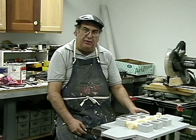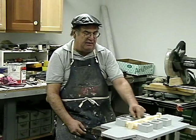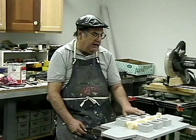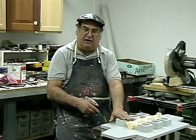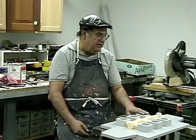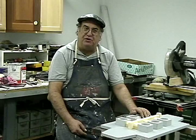So now what I'm going to do is I'm going to go ahead and wax these up, get them all waxed in, scrape them with a little scraper to make sure the wax fillets are smooth, and paint it up with some lacquer, and it'll be almost ready to go. And then I have the covers to mount up, and I'll show you how we're going to mount those up a little bit later. But it's fun making patterns. I enjoy it.